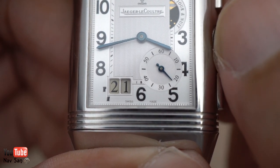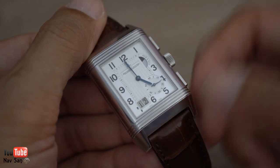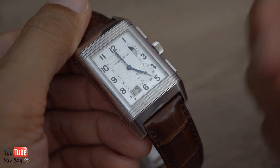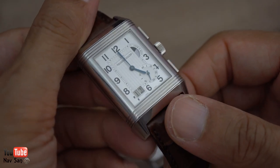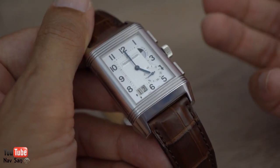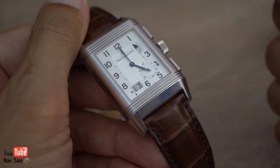The date window uses two discs that move independently — the bottom one moves on the right-hand side as the days progress, and then around 20 or 22 they'll both move over together. There's a constant seconds hand running on the right-hand side. At the top is not a moon phase but a day/night function — as the day progresses it moves between day and night. When I first saw it I didn't like it, but I understand the reason: if you're using this as a GMT watch with one time zone on each side, you need to know whether it's day or night. If it's 5 p.m. here but you don't know if the other side is 5 a.m. or p.m., the day/night indicator tells you clearly.